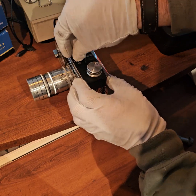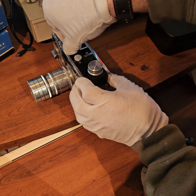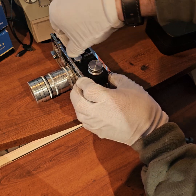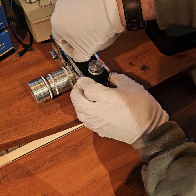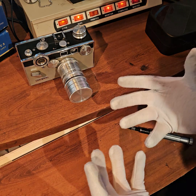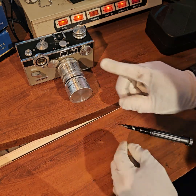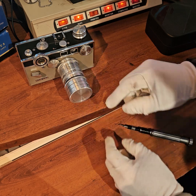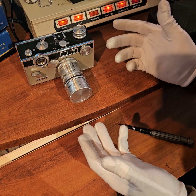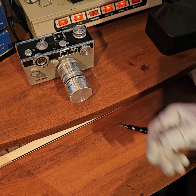The information I found on this comes from an Argus C3 instruction and service manual printed for the U.S. Army — I'll put that link in the description below. It has a lot of helpful information, and since I was infantry myself, if it was made for soldiers it's going to be easy to understand. The one problem is that they have the vertical and horizontal adjustments mixed up, so what they describe for the horizontal adjustment actually adjusts the vertical alignment and vice versa. Just know that going in.